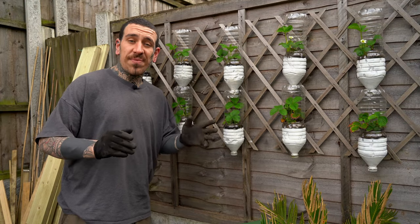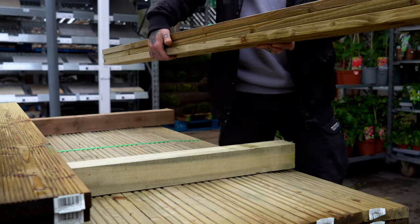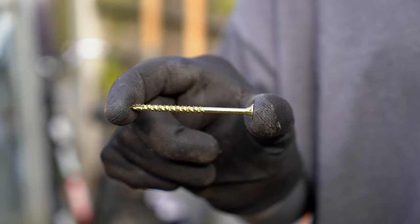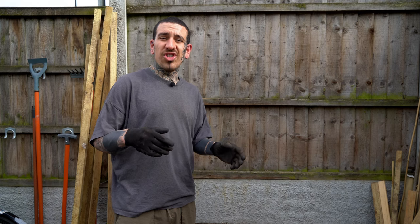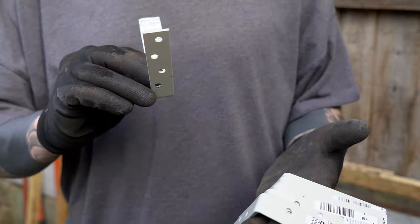I went to the local DIY shop to source some materials but I also had some second-hand wood kindly given to me by my neighbours. I'll measure the area where I plan to fix my structure to support my pots and grow strawberries vertically. I use 2.5 inch screws so you won't have to drill any pre-holes — you can just drill straight through as the wood won't split. I'll measure the distance between the top and bottom of the space available and divide it into equal distances. I'll fix one 17 inch timber horizontally for each section, then fix brackets every 24 inches to mount a water-resistant shelving, which will be the main support for my strawberry pots.